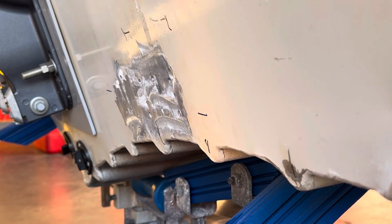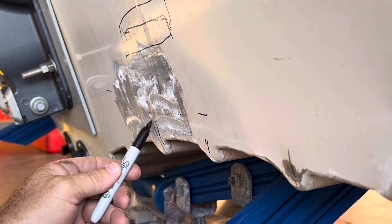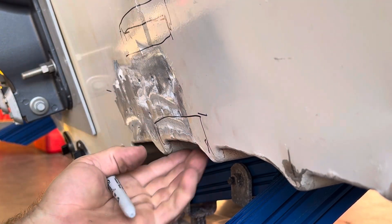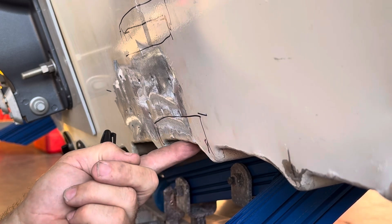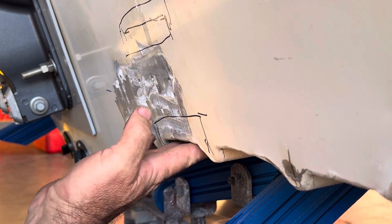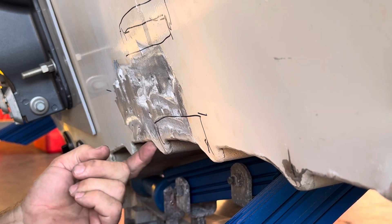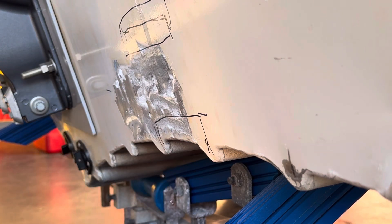I'll remove all of the paint from this section down here and clean off this area as well, using an electric wire brush. I'll put a couple of little stitches on the top and bottom. I did see someone on YouTube mounting a transducer where they ground this weld away — obviously not a fabricator. By grinding that weld away to make it absolutely smooth, you lose the strength. This little weld will give a bit of interference but you don't want a cracked hull — this is where they all crack from the torque of the motor flexing on it.